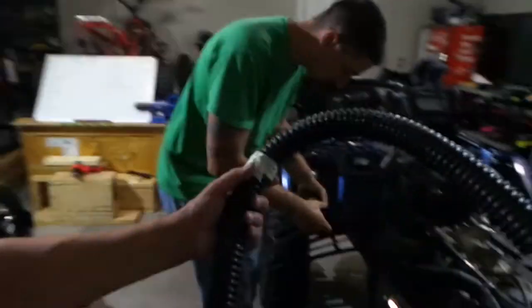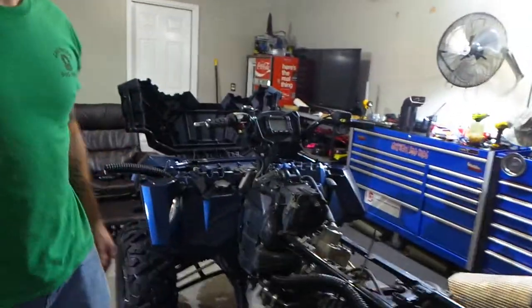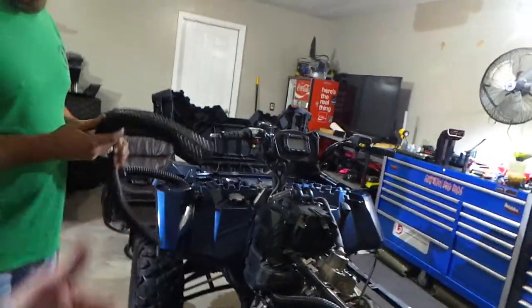What you do get with the kit is pre-planned angles. If you go plumb this yourself and just go to Home Depot or whatever, you're going to grab some 45s, some 90s, and hope for the best — probably run back to Home Depot or Lowe's one or two times to get another fitting. This already comes pre-planned, and if you read the instructions, even the hoses are marked. This is a 36 hose, so we know this length goes to this adapter and this 45 goes from here to there, expediting a lot of this mission.